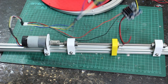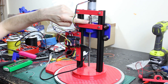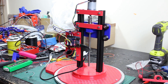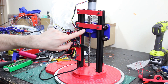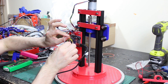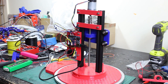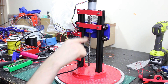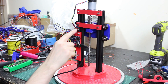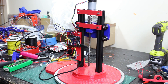This motor's got an encoder on the back, and we've got an Arduino and a motor driver which allow reading of that encoder and positioning the slider. I've fitted the motor to the top, and we've got a coupler, some bearings for the lead screw, and our sliding thing on V wheels. I've made a difference to the code from last time — originally we typed numbers into the serial terminal to position the actuator, but now I've hard-coded it with two pins so grounding them should move it up and down. We'll have a dedicated Arduino handling the slider positioning using interrupts on the encoder, separate from a master Arduino that drives servos, an LCD display, and handles buttons — that's why the interrupt handling is separated.